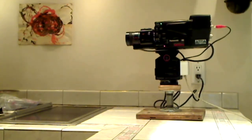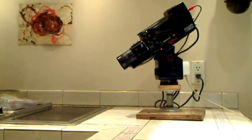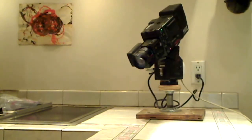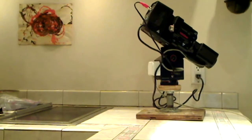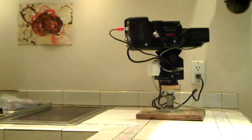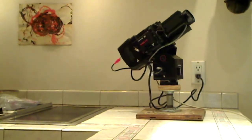I specifically engineered this for my purpose, so if you're looking for a tool, you're gonna be interested in what I've done. The lens itself has a remote zoom running through the wide Ethernet back box on the back of the pan and tilt base. All it takes is that Ethernet cable to the little remote controller I built — zoom is controlled, pan and tilt is controlled, and there's a video output via the red RCA cable.